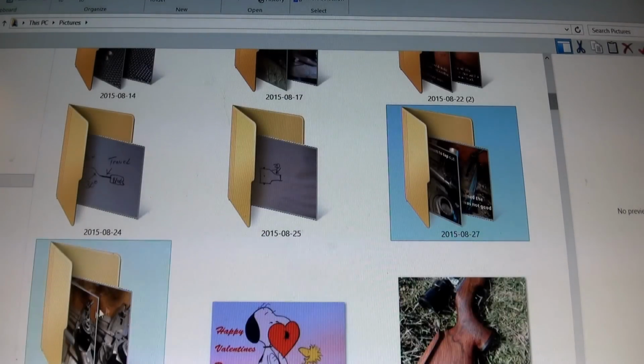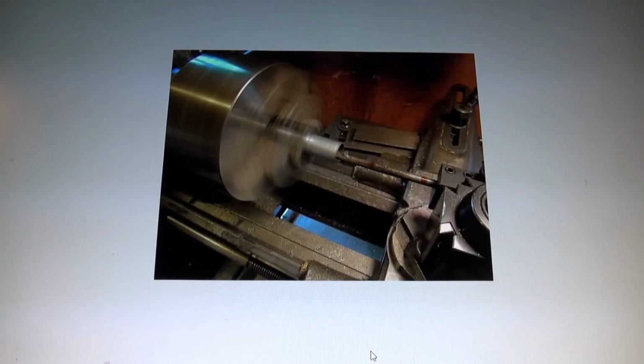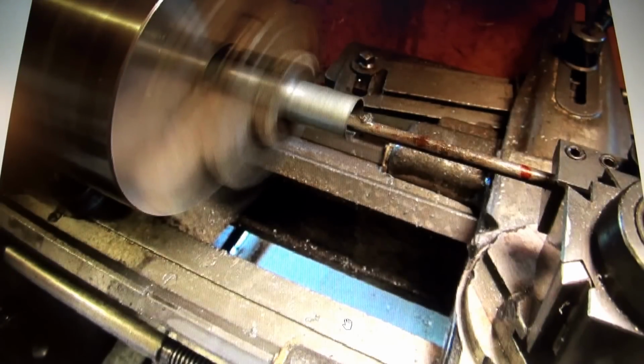Next, we go to some galvanized steel that I found. Let's just begin here. I found some galvanized steel, and it's weird trying to machine a galvanized steel pole. So this tube actually worked out pretty good. I was surprised. The spring would not go inside, which told me that I knew I could bore it, and the outside was too big to go in the piston, so I could use this, machine it down, and bore it. And that's what brings us to this part of the venture.